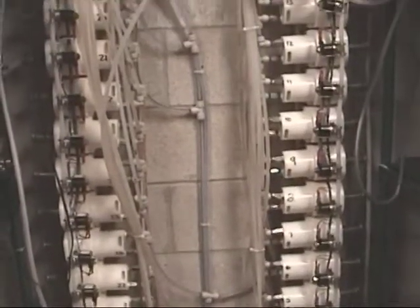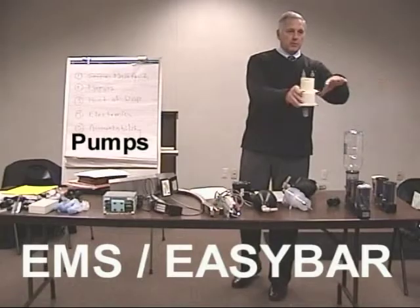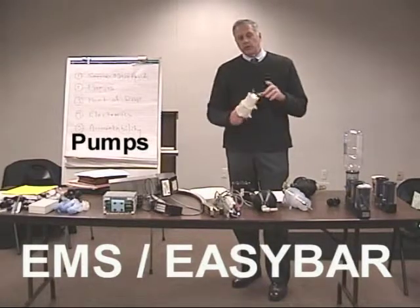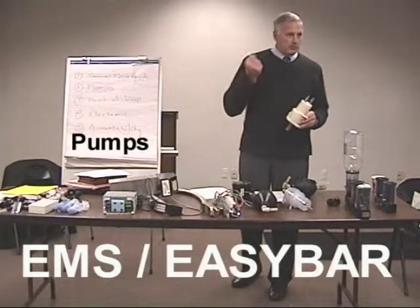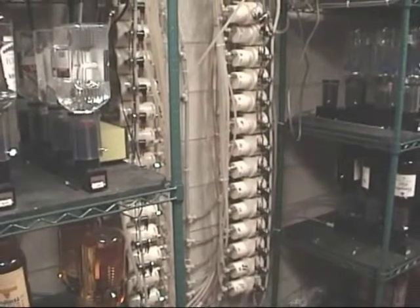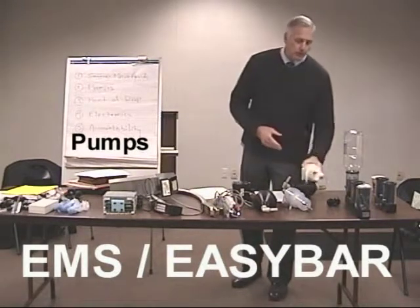And pumps can be mounted above the source. If you're in a portable bar situation, the guy wants a portable bar, 6 brands, you can put this up in the dead space that's up in this bar area. It's got a lot of flexibility. The only thing is, when you get it up high, it takes longer to load because it has to draw that liquid up toward it, as opposed to having it, say, equal, if it's on the wall, and you kind of keep it equal with the shelving that is going to the pump, you get quicker recovery.